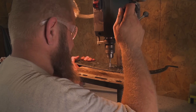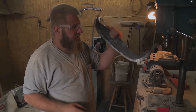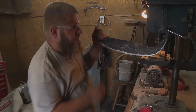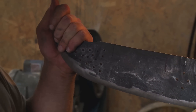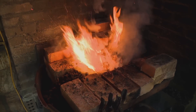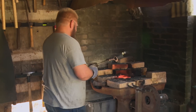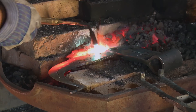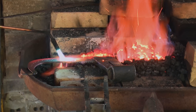These holes in the bardiche blade made the blade a little lighter. Got all the holes drilled all the way through — looks pretty cool, I think. I'm feeling a little nervous about the heat treat. The moment of truth — I'm edge-quenching, hoping for a hard edge and a soft spine, therefore reinforcing the blade.